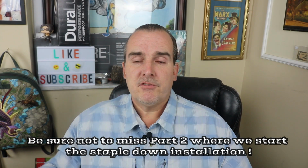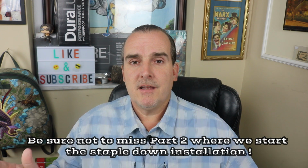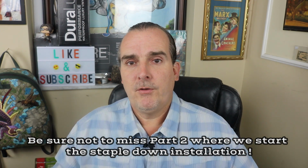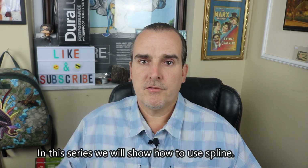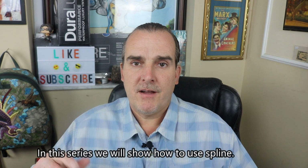It's a lot of information, but the point of this video is, no matter what kind of floor you're installing, try to make sure you lay it out so most of it is in front of you. If you're doing laminate or vinyl, it's just a lot more difficult to go backwards, so you want to try to avoid it if possible. If you're doing nail down wood, make sure you buy some spline, because that's the only way you can reverse your flooring.